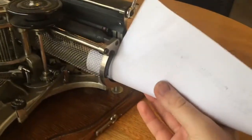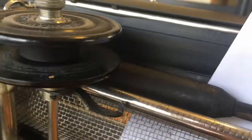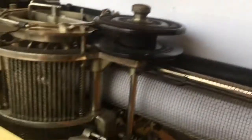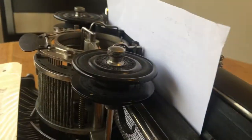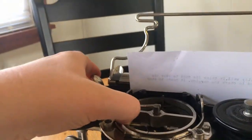Then you're going to have to roll the paper up like this. Once that's done, you have to slide it in between the carriage, the feed rollers, and the impression strip, which is a piece of rubber that is used to cushion the strike of the hammer, because this machine operates with a hammer hitting the type shuttle from behind. Once that's done, we can close the paper release and push it over to the beginning of our line.